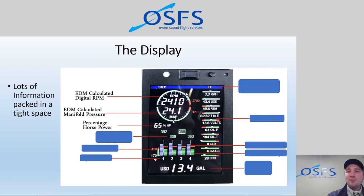But just as a heads up, that's a big part of why we opted to add the extra sensors for the 830 versus the 730, so that we could make that correlation to the POH cruise performance tables and numbers, and see what we get in real flight, and then take that real-time information and make real-time decisions on leaning. And ultimately, it comes down to engine care at the end of the day. So that is that.